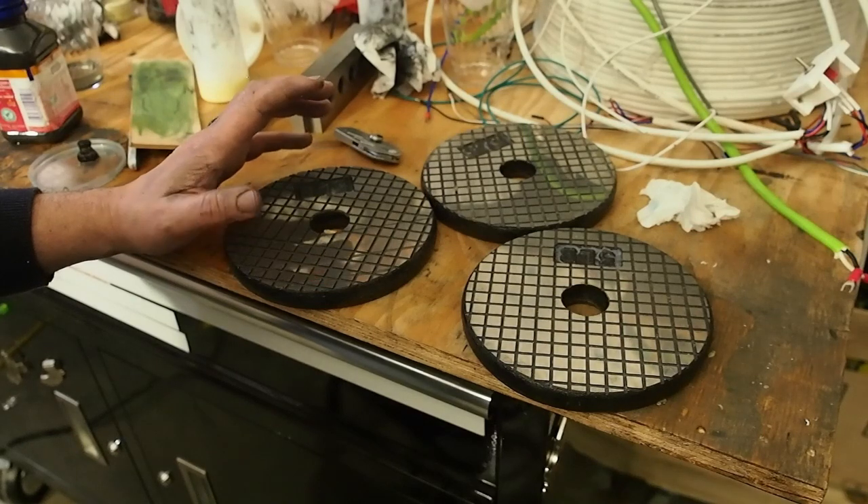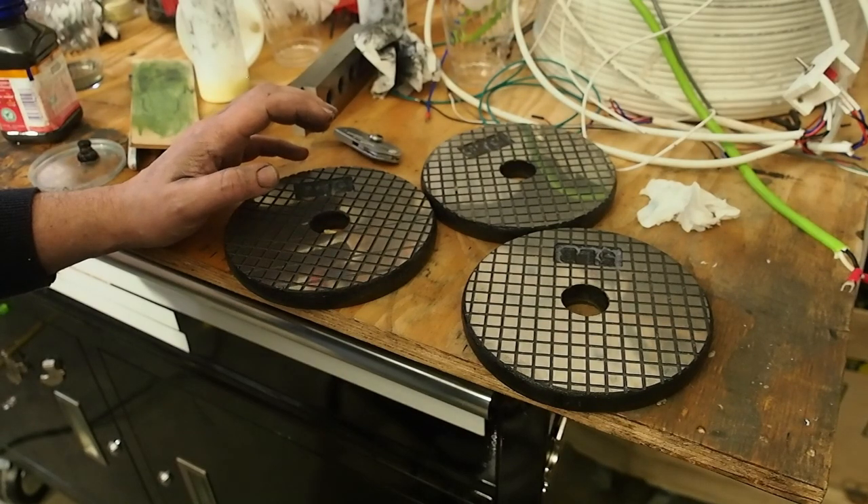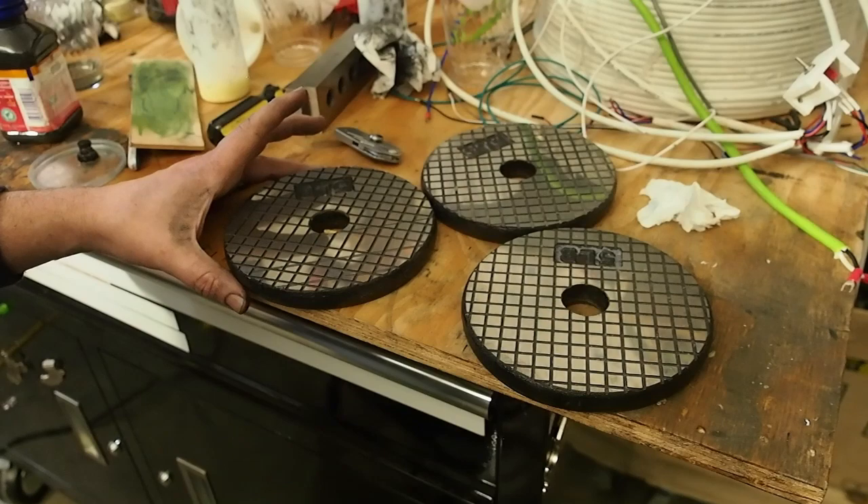The other way to do this is instead of looking at this surface — which is reflective, you can see details in it — I may try to lap something on the plate and then take a look at that. It'll be easier to clean, and I'll have an overall more flat surface. Maybe that'll be the next thing I try to do. Thanks for watching the footage on the optical flats. If you have any comments, leave them down below. Hopefully you can fill your quarantine with something useful, like making lapping plates.